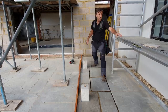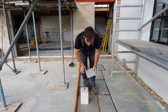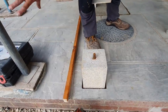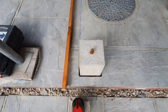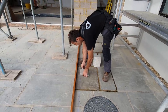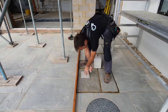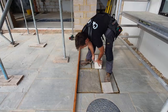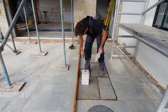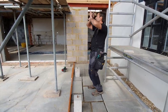We've done all the measuring here. This bit of ply represents these stones here plus a mortar joint, so where we cut them out — for example, we've cut this one out here over the existing foundation that runs through here. These ones here we're going to cut in situ, so we'll remove them there, put our plywood here, score around that — this is where we're going to cut out. They'll then get bedded down onto the concrete foundation underneath, nice and level and pointed in.